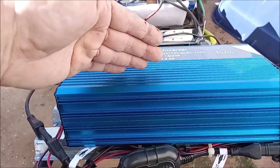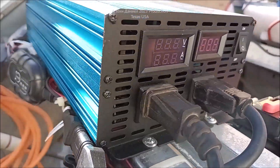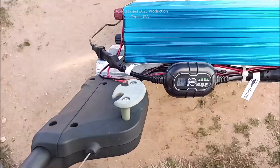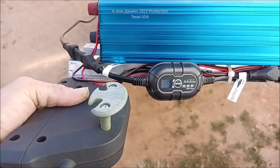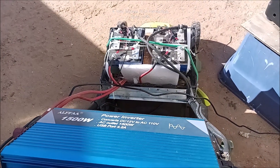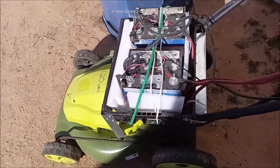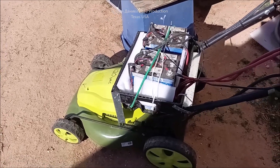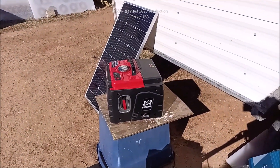So I have this 1500 watt inverter here, and I'll show you just by powering it up. We'll hit the power — and now we've got power. I'll get this cord out of the way. Out in the grass, it's not going to produce much dust at all. But under a full load, when this is loaded down — we went over and cut some heavy weeds with it just to see full load — it was still under 5.5 amps. That still gives me four and a half hours of runtime on one charge, then I just bring it back in and plug it in.